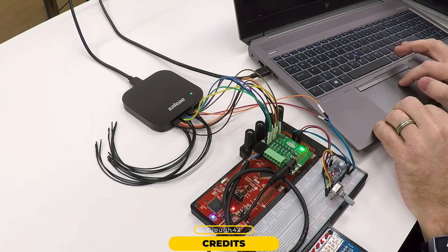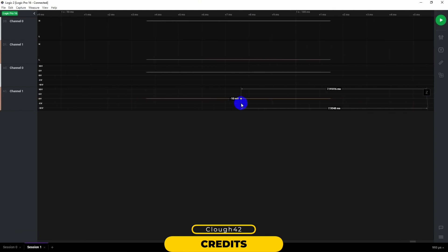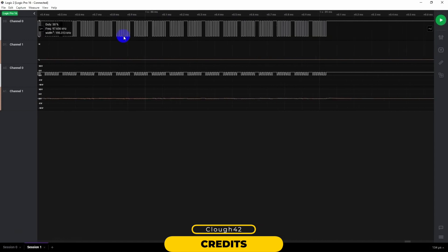There are small logic analyzers you can purchase for quite cheap compared to a traditional CRO. People into traditional electronics will prefer a CRO, but if budget is a concern — since CROs are really expensive — you can either buy a second-hand one or go for a logic analyzer. The one I recommend is the Saleae logic analyzer. It connects to your computer via USB and has probes you can attach to your electronic circuit to debug it on your computer — you can see the waveform, frequency, amplitude, and more. This skill teaches you circuit debugging, reverse engineering, and troubleshooting. In an industry setting where circuits are designed and debugged, these instruments play a really important role and you should know how to use them correctly.